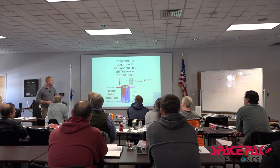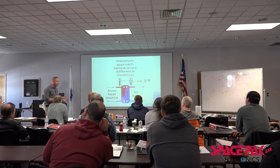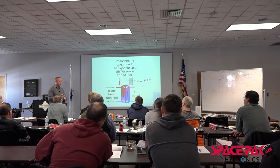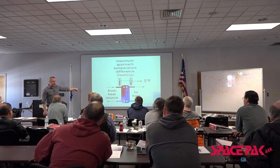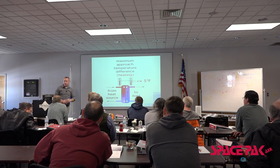And why do I say that? Because generally, there's a 5 to 7 degree load difference, right? So when I say, okay, we're gonna run our outside unit at 130 degrees, if we know that we're gonna lose 5 to 7 degrees in here, the most we're gonna make that water in that buffer tank is 123 degrees, right? We want to be a little over that, so now we've just resigned ourselves to the fact that our buffer tank is going to be 120.